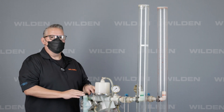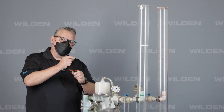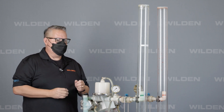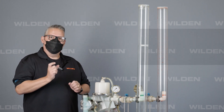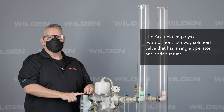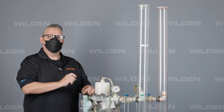Now in a traditional P.025, the inner piston makes contact with the pilot spool. The pilot spool then goes either up or down depending on the position of the inner pistons. On the AccuFlow pump, we actually remove the pilot spool assembly, and it is replaced by a plug, and the shift mechanism is all done through solenoid. So the solenoid controls the air valve spool and tells it when to shift up and down.